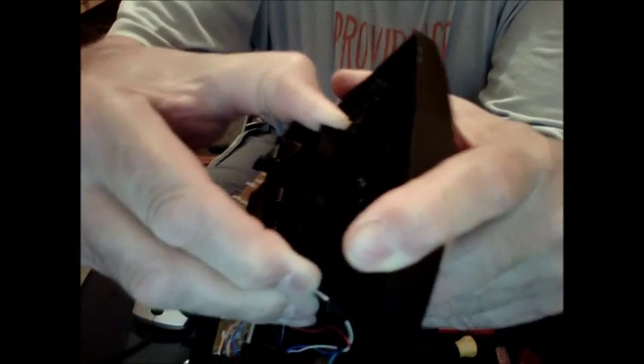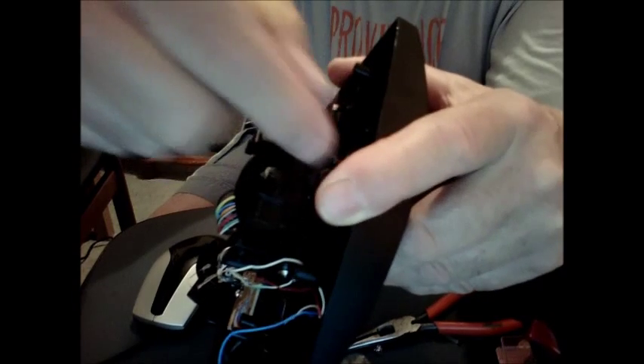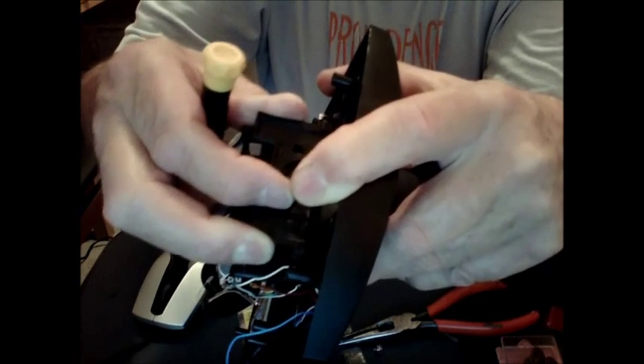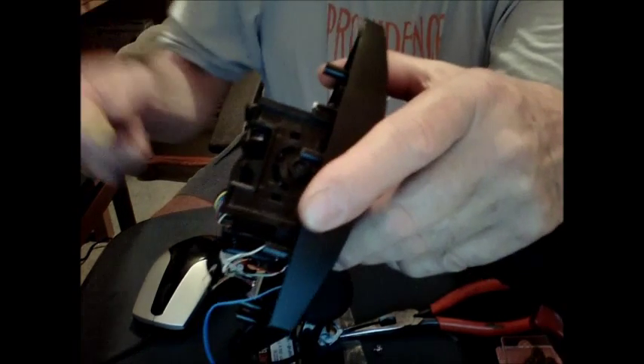To drill the hole in the end of the axis you need to raise the board that's in the slot. It comes up — raise it up without taking it right the way out, just high enough for you to be able to get the drill into the end of the axis. This plastic post — I have not been able to find any purpose for it, it's probably an alternative part of the design. If it's in the way you could even cut it out. It's a tricky job getting it up high enough to clear that post to get your drill in. You may want to cut the drill bit shorter — just enough length for the shank.